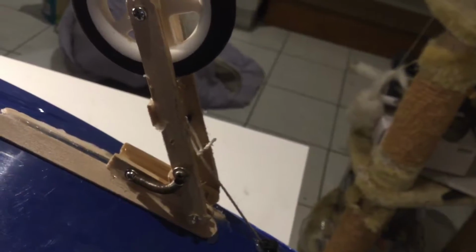And then I don't know if you guys can really tell very well, but there is a metal pin that goes through here, and I've got this carbon fiber rod which then fits in between it, so that makes a pivot point. And then for it to pop back, I just got a spring, screwed it right to the side, so now that's all the way down, it will pop straight back into place. So that's how I've done the front. I'll show you the back.